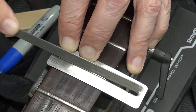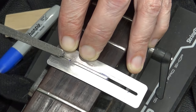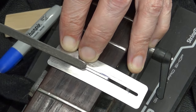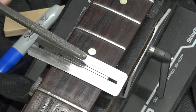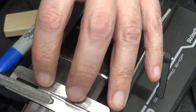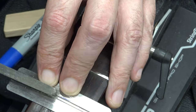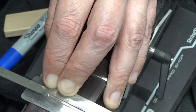I'll do this for the other two — maybe even do the fourth one slightly. This is a single-cut bastard file, so it leaves a very smooth edge. There's not much to polish after using one of these — it's kind of like using one of those diamond crowning files. By the time I'm done polishing them with sandpaper, these little dents will disappear.